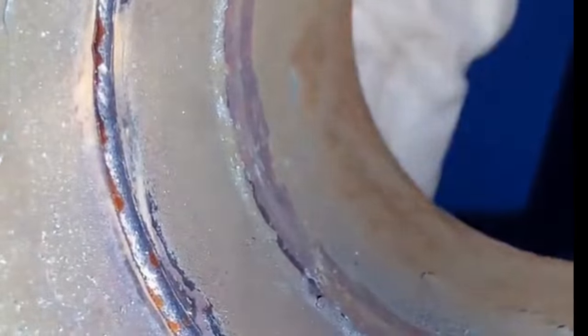When welding in the first half of the circle, we must pay close attention to ensure that the welding wire is constantly controlled. The molten pool temperature is often mismanaged by many novice friends. During practice, I felt that the difficulty of the upper half of the circle was relatively low, and relaxing vigilance led to broken wires and falling flows. We must pay attention to the key details in normal practice, attach great importance to them, and concentrate our attention.